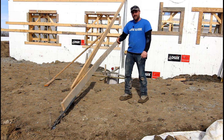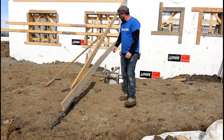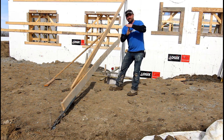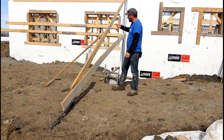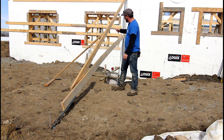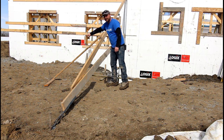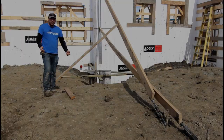Now I want to show you what it saves you, and that is mostly for guys who are framing. We have a small example here. Normally if I was doing a long brace like this I would just do a tee, and that way as I put pressure on the wall it prevents it from bowing. Because we're in the middle of a pour we had to just get this done, so we stuck this two-by-four down to a steel pin over there, and that's how we straightened it and made it perfect.